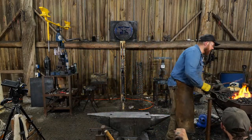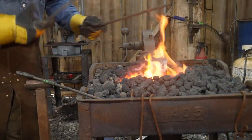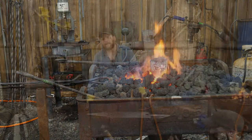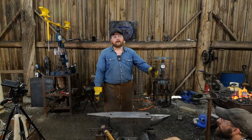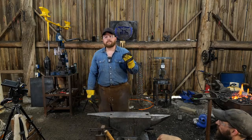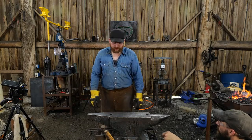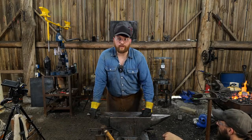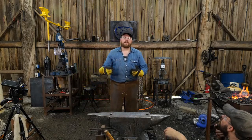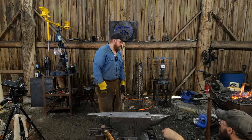Again, the treadle hammer kit was designed with an entry level in mind, right? It's not an Anyang. It's not a Ken's custom iron hammer, a KZ100 or anything like that. It's not these various larger hammers out there. It is whatever you've got for a sledgehammer on hand and your air supply, or your foot cranking power. So it is meant to be an entry level option for people to get into powered hammer work, you know, actual mechanical work.